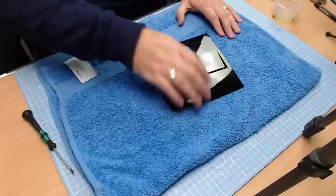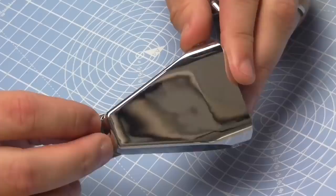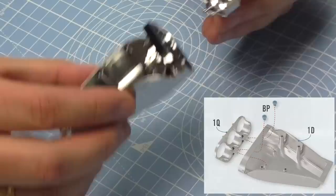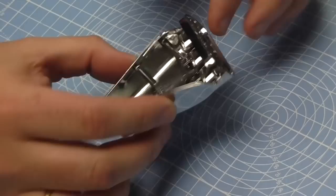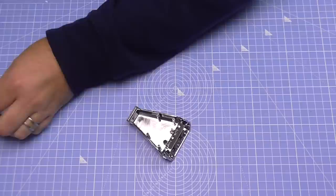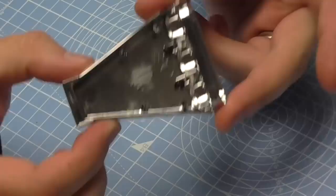These are the two parts of the supercharger we need now. As you can see, this is chrome-plated plastic — absolutely flawless finish on it. We obviously need the intakes for the supercharger. Quite simply, these are just going to go into here over the two screw holes. That's going to be held in with BP screws. Normally if a screw code ends in a P it means you're going into plastic, and if it ends in an M it means you're going into metal — which is when I add a little bit of oil. Since this ends in P, no oil needed.